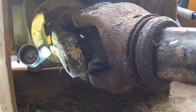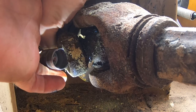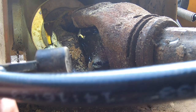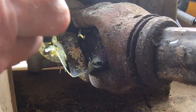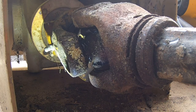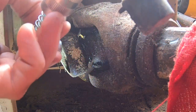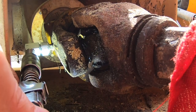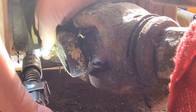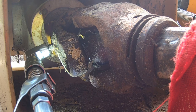I'm going to put a little bit of grease on it. Actually, I'll attach our Lock and Lube to the 90-degree before I put it on the fitting — so that's locked in. Getting grease everywhere. Good thing I've got a rag. Now I'm going to take my fitting, loosen it up, and slide it over. Now with that on, I'm simply going to tighten up that knurl. Our grease fitting is now connected — all I need to do is pull the trigger on the grease gun.